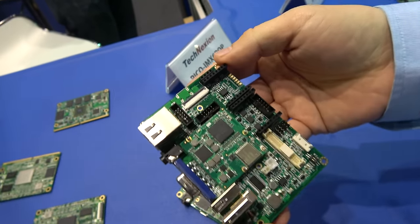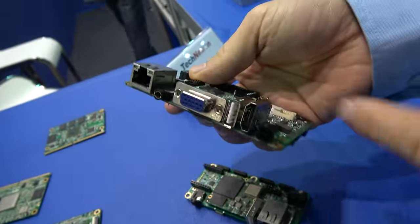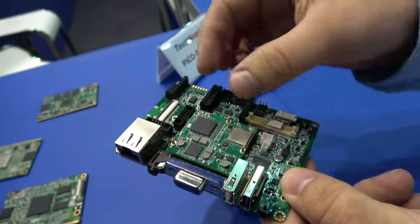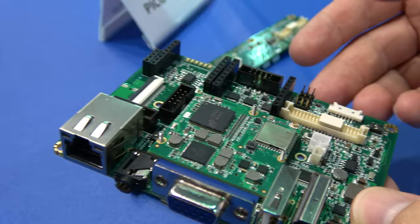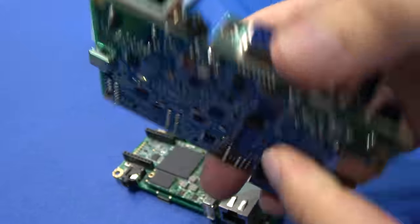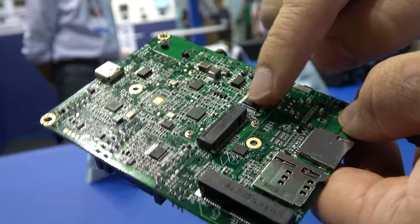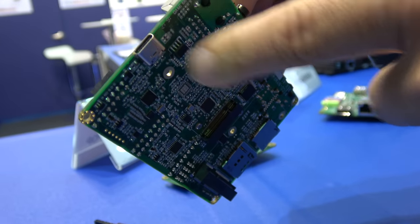Let me show you this board — it's an all-in-one solution. You have a ratchetized power supply connector that's clickable, so it won't fall off when connected. You have HDMI, USB, VGA, and Gigabit LAN. It uses the same module system, so you can change the module — if you need a quad, you have a quad; if you just need a solo or ultralight, that's all possible. You get an LVDS connector, a MIPI interface for a camera, and on the back there's a mini PCI Express, a SIM card holder, microSD storage, an M.2 connector, and of course USB Type-C.